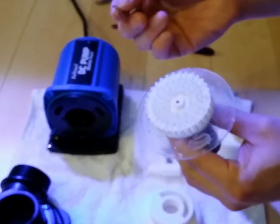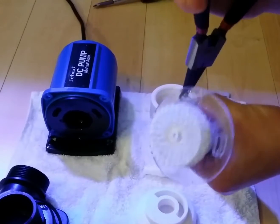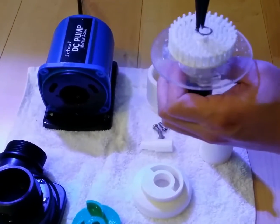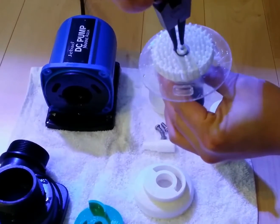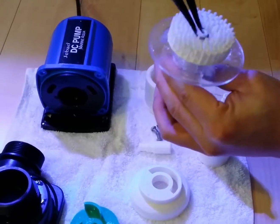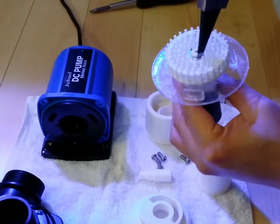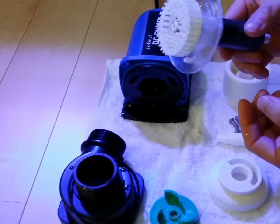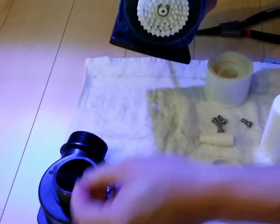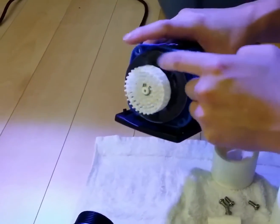This went all the way in and you can put the retention clip back in. Just to make sure it's in good, press it down again to make sure the clip is clipped in. Now you're done with the impeller part — put this back into the pump. Don't forget your O-ring seal. That goes behind the clear part of the plate.